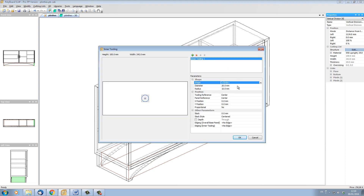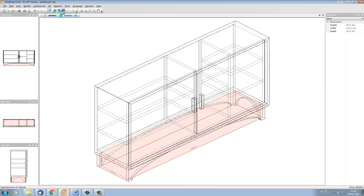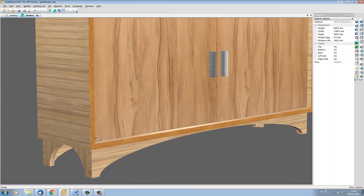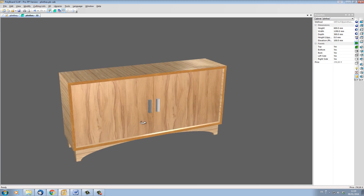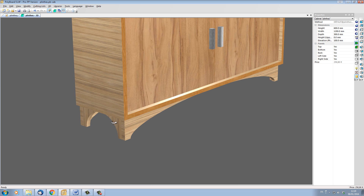Now I can cut these out in exactly the same way. I do an inner tooling, add an ellipse with a horizontal axis of 200 and height of 185, from the bottom at 0. I copy this structure, explode the cabinet to select the plinth more easily, and paste that structure on the plinth. Now we have the same thing but with our bottom panel between — that is, non-priority to the sides. It's important to note that the front and side plinths are now butt jointed, not mitre jointed — you cannot mitre joint them in this configuration.